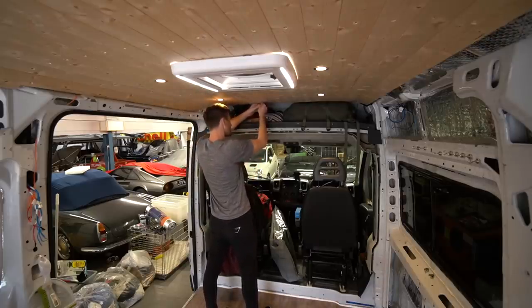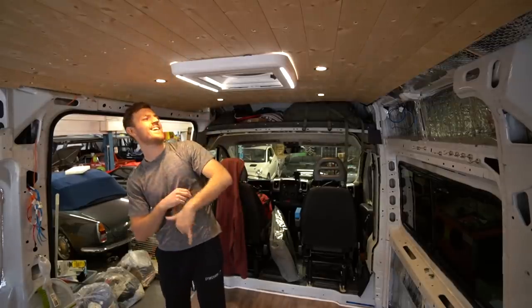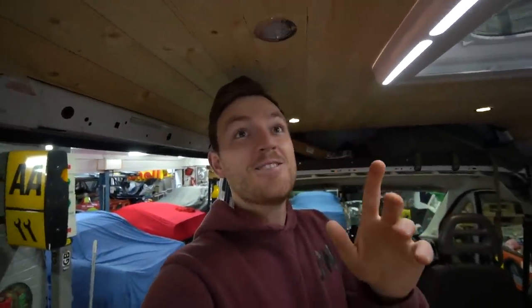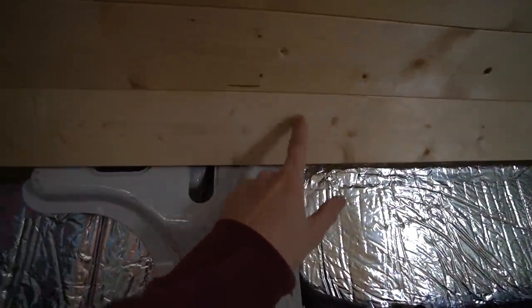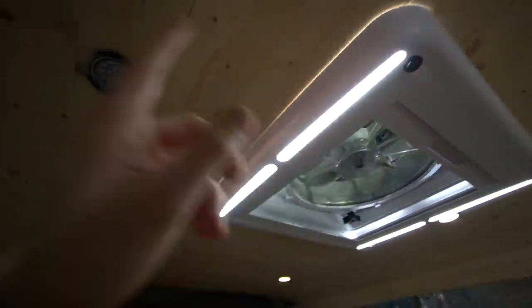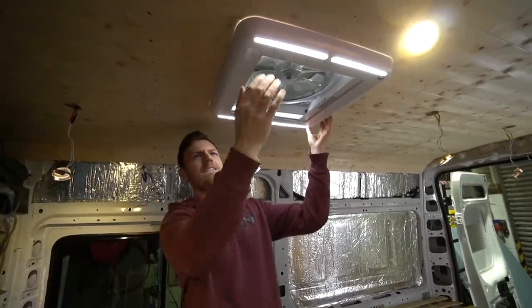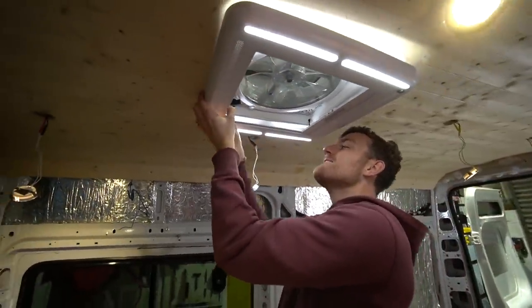The next job on the list was to sand down all of the screw holes and light fittings to prepare the ceiling for painting - but first we've got to have a bit of a boogie. The moment has come to finally start to paint the ceiling. All I've done so far is prepare the cladding by filling in any existing holes and sanding all of the screw holes and any edges. So what I'm going to do now is take out the lights - I've dropped down these two already - take the cover off the fan, drop out the rest of the lights, and then hopefully I'll show you the process of painting this ceiling.